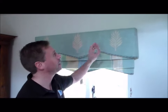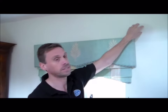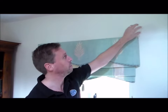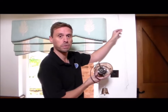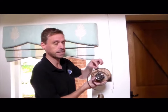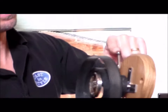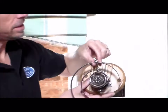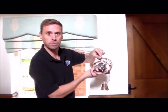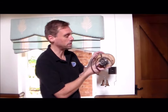Think about where you want the bell positioned. The blanking pulley will be fitted where the cord comes through the wall. We'll then position the bell lower down with the guiding pulley and directional pulley in between. The butler bell has a little arm on the back with an eyelet — the cord pulls onto this arm in a vertical motion to make the bell ring, so we need to train the cord along the wall using the pulleys to achieve that motion.